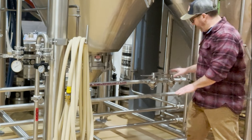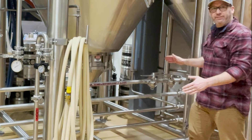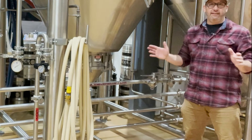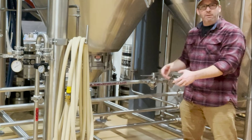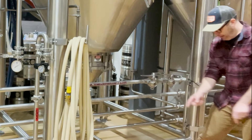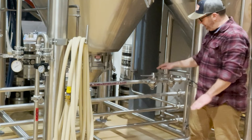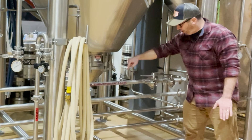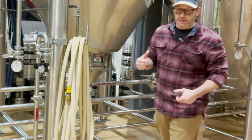What we have is two or three valves right here. What that enables us to do is, say, I just wanted to take a transfer line and sanitize it. You would put your appropriate valve, sight glass, block and bleed — whatever you need on there — and connect to here, loop, connect to here. You can open both of these valves, and then typically we'll close this valve, meaning all the water is being forced through and completing the loop.